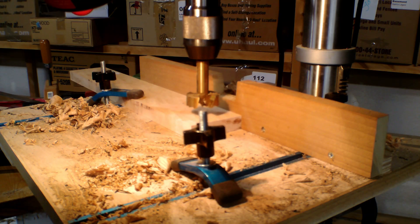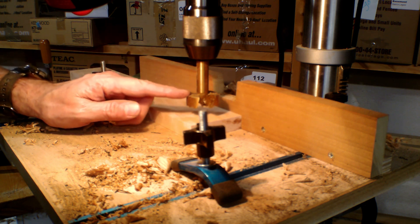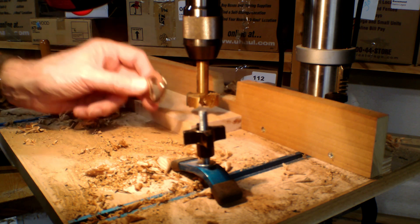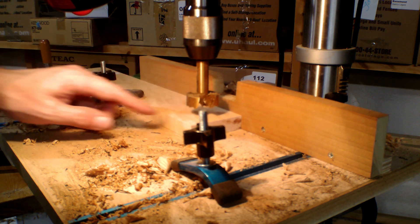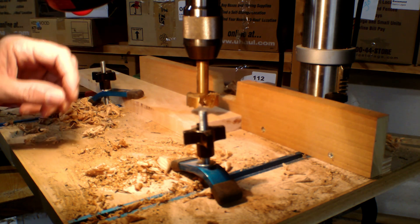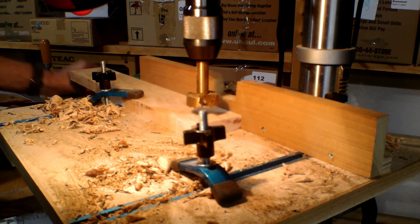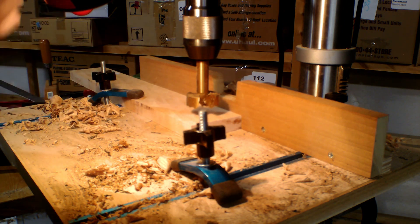First step in making this pocket bottle opener — I got a piece of maple here chucked up and held down. I have an inch and five-eighths Forstner bit. This is just a skosh over an inch and five-eighths — it's probably metric. What I'll do is put that in first, just enough to recess the piece about a sixteenth of an inch. Then I'll come back and drill a hole around it using a hole saw bit, and then put in two smaller holes for bottle cap clearance. So let's make some noise.